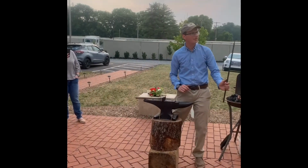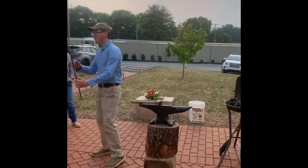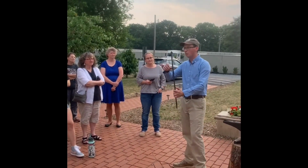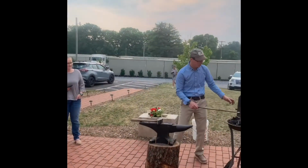Then have a wide leaf there. So now what I'll do is, you can see it's pretty thin down here and then thicker up here. I'm going to make this longer, more of a taper, which means it goes from a thinner piece of metal to a thicker piece of metal. So make that a lot thinner.